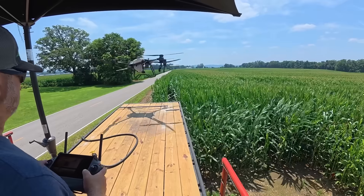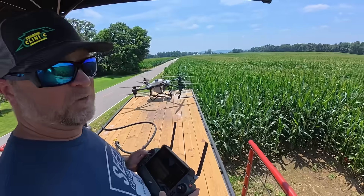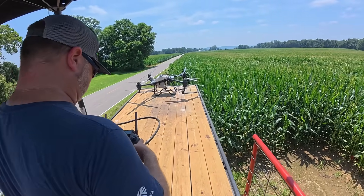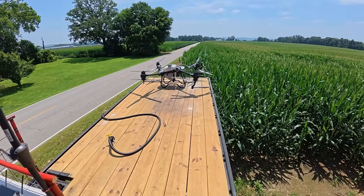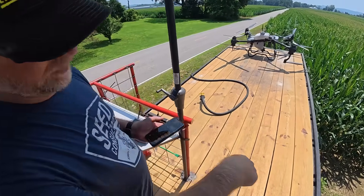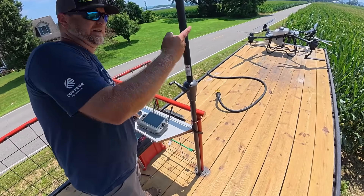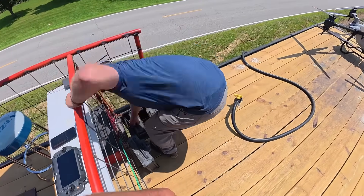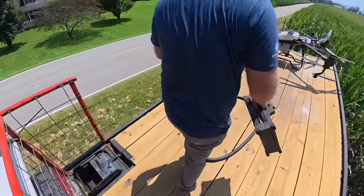There's the air conditioning. You get a pretty good gust of air when the drone takes off — the crop blast is actually pushing that fungicide down into the canopy, which is the theory. Now we'll see how quick we can do a swap and get him back in the air. First thing I have to do is record how many gallons are still in the tank, because I don't have any way of knowing if the inductor is empty downstairs — so I subtract out what's left. Only one battery is charging at a time: one charging, one cooling, one running.